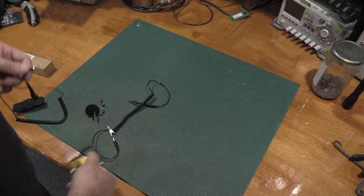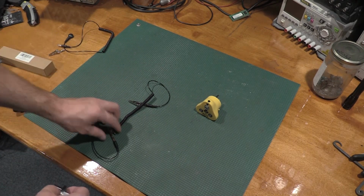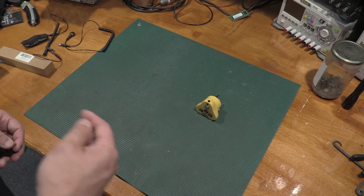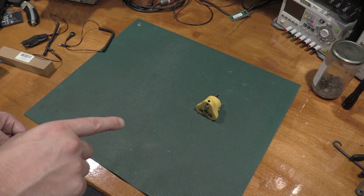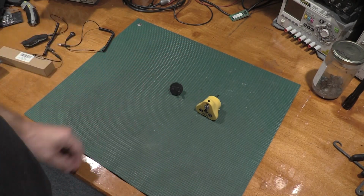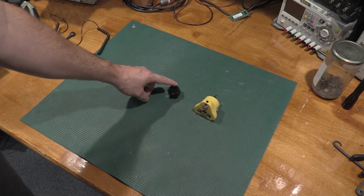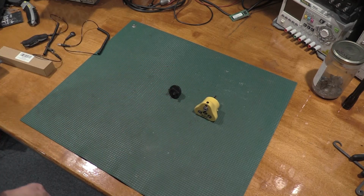Now, theoretically, an easy way to do this is to just pop this in here, and we're good to go. But we're going to do something a little different, because I also am going to be doing board assembly, so I need to ground some soldering irons too. Now, the Hakko iron that I have is grounded through the tip, but I'm also going to ground the holders, the brass brushes, and a few other things in it, and we're going to go into that a little bit later. So I also have this connector, and we're going to test this because there's a reason I picked this one up thinking it would work, and then I thought about it for a little bit, and this might have a flaw in it that I want to talk about. I know this one will work and doesn't have the flaw that I'm worried about.